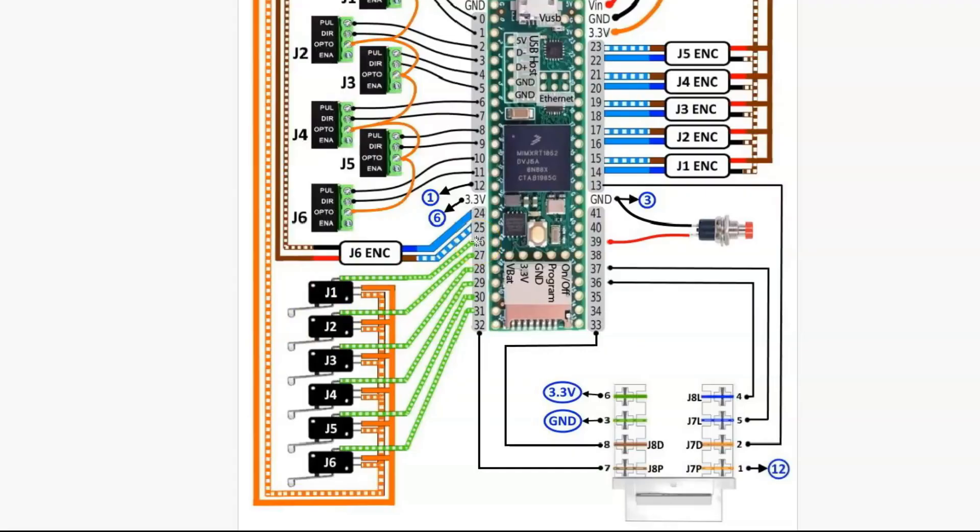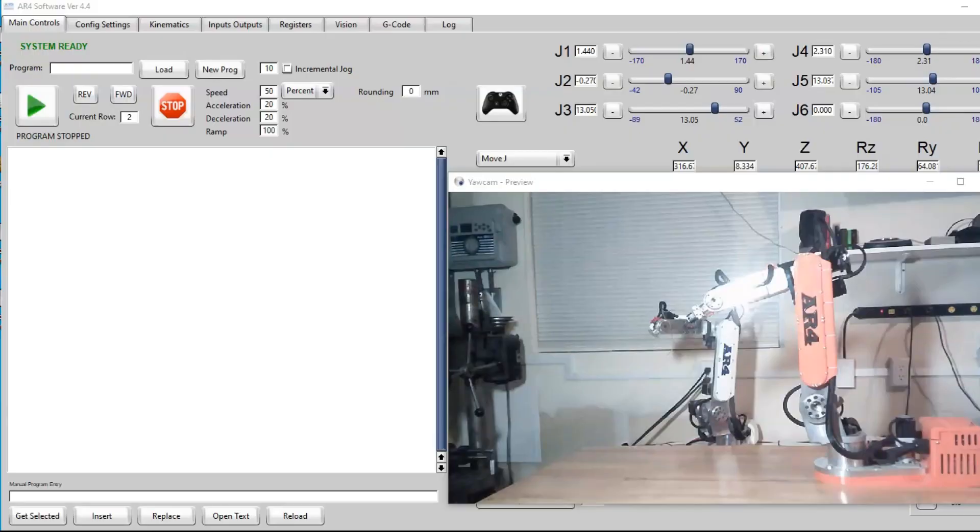If it's not doing that, you're probably going to have a floating voltage issue. Those are the things to test — just make sure every single switch is providing a solid ground when it's off and a solid 3.3 volts when it's on.